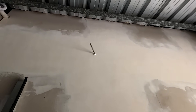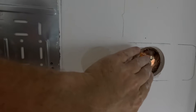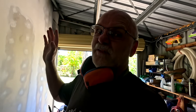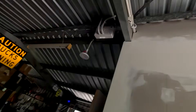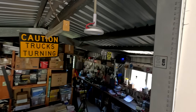That's our point of exit. You can see the hole is going in at an angle, which allows for a smoother bending of the cables going through this hole to the outside, and then a smooth bend again on the outside as well. I've done the same over there, so it goes really smooth — no sharp corners. That should be fairly easy for the electrician to bend. The original pipes from the air conditioner should end outside over here, then the extender pipes follow the path of the conduit. They recommend about 2% fall per meter; we've got only 800mm here, so that should be around 16mm.